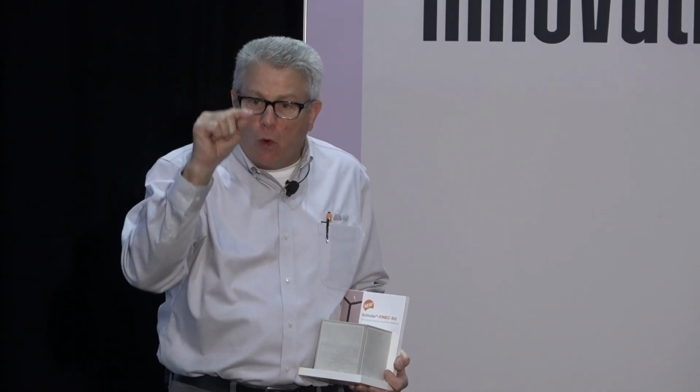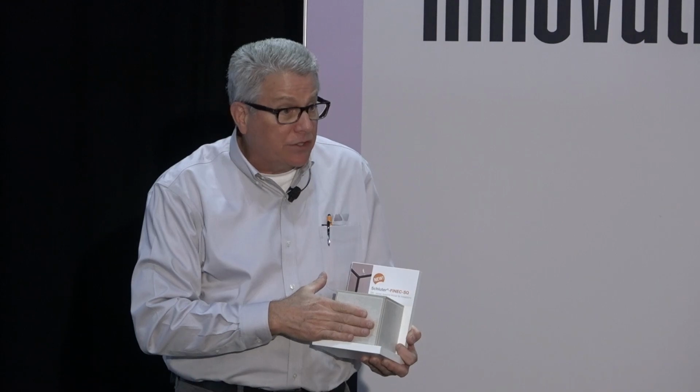The nice thing about this SQ is you only have to take out, I don't know, the bottom third, maybe half at the most, of the back side of the tile, so you don't even encroach on that vulnerable top corner of the edge of the tile. You're just hacking off a little bit out the bottom, so it can be done very quickly. You don't necessarily need a wet saw. I think a 4-inch angle grinder with a dry blade, and you can just scarf the back out by flipping the tile over and clearing enough of the material out, and you can slide it right up against there. And again, it doesn't matter what the thickness of the tile is or how thick your bond coat is, that's all you're going to see.